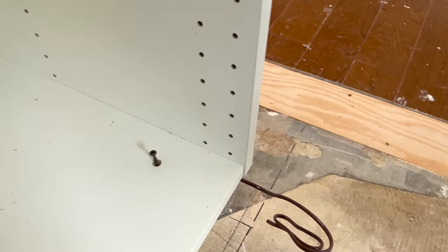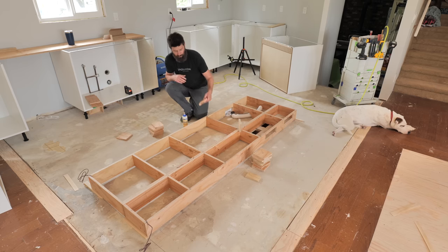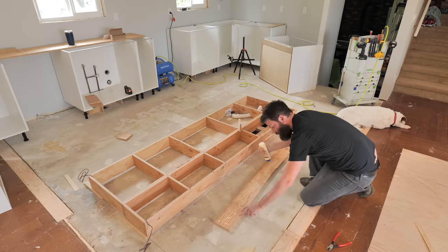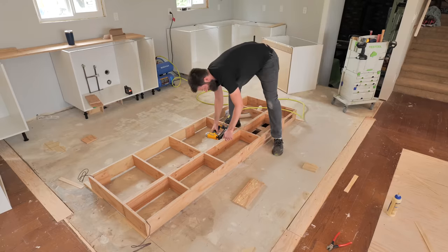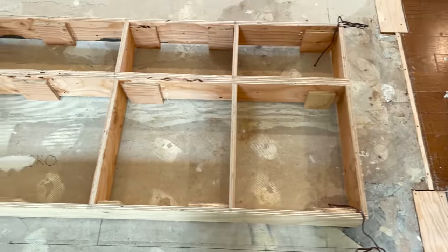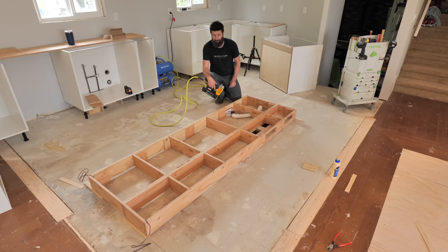In order to get this thing rock solid, take these plywood scraps that are a little bit shorter than your kick, take some wood glue, glue them all up, and then nail them on with your nail gun. I like to use inch and a quarter nails so they don't shoot out the other side. When the wood glue dries it's essentially going to be another piece of plywood down to the floor — rock solid — and that'll hold thousands and thousands of pounds. We've got the blocks in all over the place. Give it 10 or 15 minutes before you throw the cabinets on there just to let that glue tack up a hair.